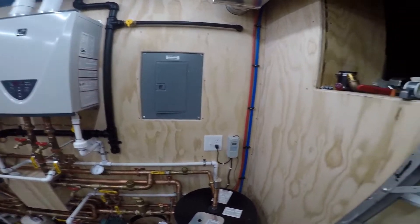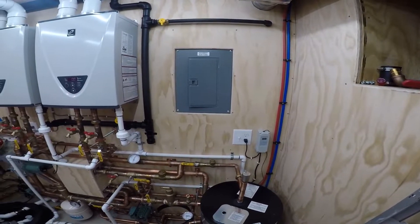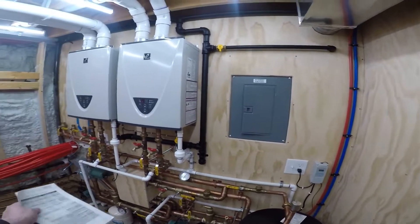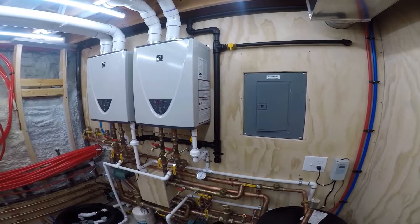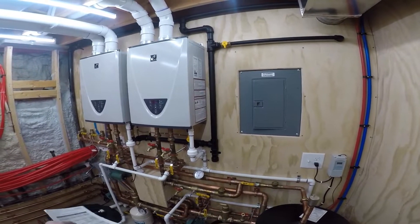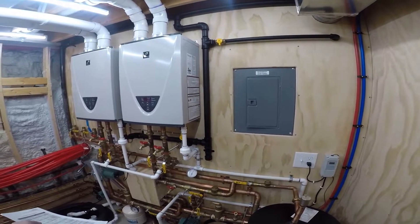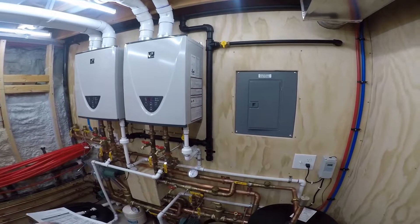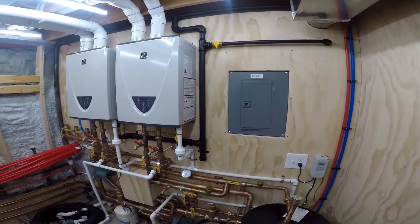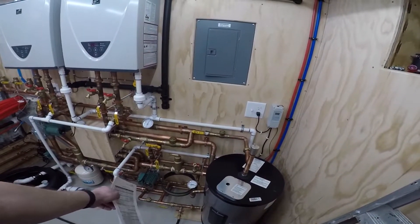The system works — tank's at 131, shower's still on, and now with both units flowing 8 gallons a minute, that's pretty much endless hot water. Before with just the one at 4.3, there was a chance that if you had fixtures in the house drawing more than 4.3 gallons a minute, you could theoretically run out because that pump can only move 4.3.